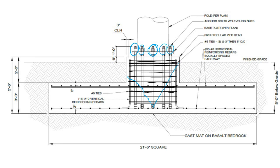Why? Because in this zone, if we apply a shear force like this one, this concrete is more susceptible to being cracked. That is why we have provided more reinforcement in this zone. So this is, you can say, due to shear, and all these are due to tension. That's simple.